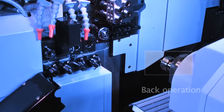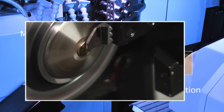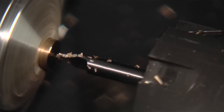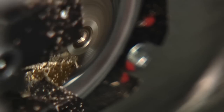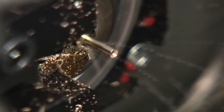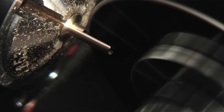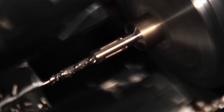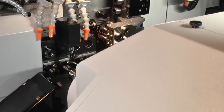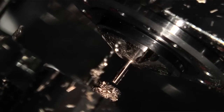And are they modular? Could you move one of the tools from a platen at the back of the machine to the front, to the side, to the left, to the right? On the GT versions we have positions that are standard on the machine, and we have modular systems that can be moved between the main operations and counter operations. Also, those tools can be moved between different machine variants — so as an example, a tool on a GT13 could be put onto a GT26 or a GT13 and so on.